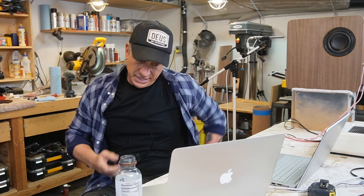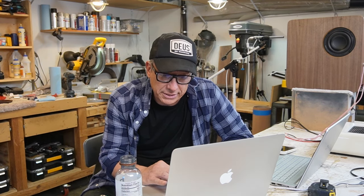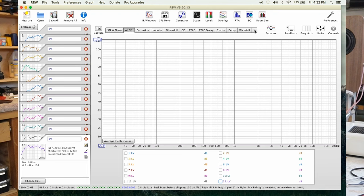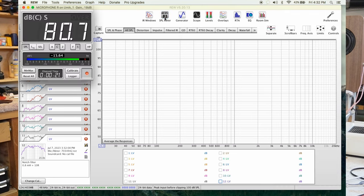All right, guys. So, we're here. It's all set up. And we're gonna get the FRD and ZMA files for those drivers. But first, I gotta record the screen. We're on. And we're gonna start from scratch here. Let's get the generator, and we have the SPL. And we're gonna just do something like 80 decibels at around. Okay, that's good enough.